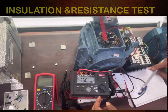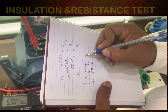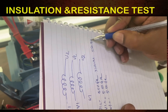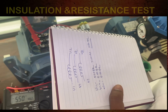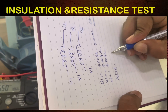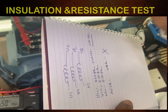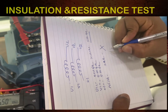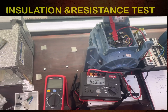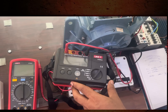From winding to body, the resistance is 5.50 gigaohms. One gigaohm equals 1000 megaohms, so 5.50 gigaohms equals 5500 megaohms. According to NETA, if resistance is below 2 megaohms the motor is not good, but our resistance is 5500 megaohms — so the motor insulation is in very good condition. The insulation test is passed.